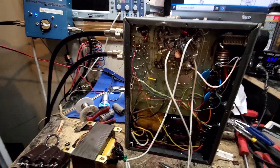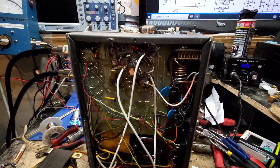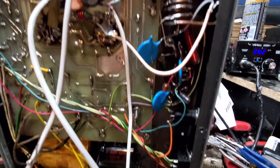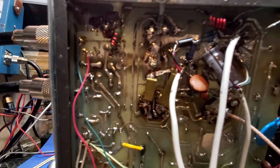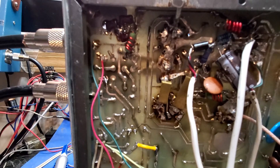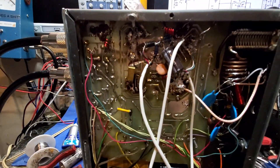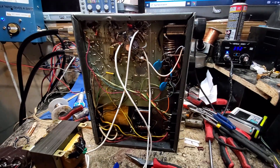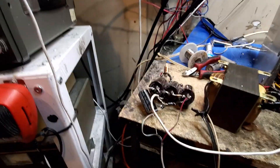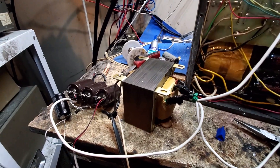This transformer is sufficient for the three final output 6LF6s — plenty for that. But now you'll notice a 6LQ — you don't very often see a 6LQ in an environment with 6LFs. To pull this off we had to add a whole separate transformer, a whole isolated power supply. This thing is dual bias, dual high-voltage packs, dual filament supplies. We changed the tuner to a Firebird 500 driver style. The feedback switching circuits are all down in here, and we had to wind that little coil, put the bias circuit in, and add parasitic chokes — those green resistors with wraps around them.